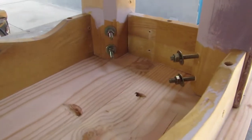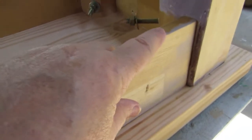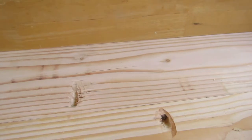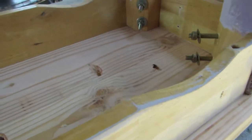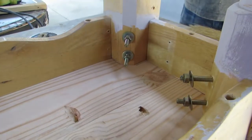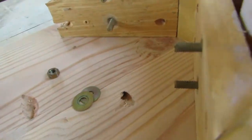these pieces are cut. It's not screwed in, but what's awesome is the pocket holes we will use to go down in there. And obviously we'll put our corner braces in, and we're also going to sister up with a 2x2, I believe, because we want to make sure with the scooting around and whatever that it stays nice and secure. And with the thinner boards, I'm just thinking to beef it up a little won't hurt it. And there are the corner pieces we're going to reuse, which is awesome.